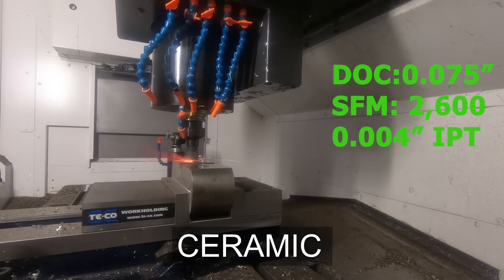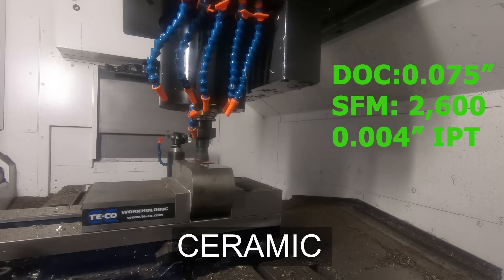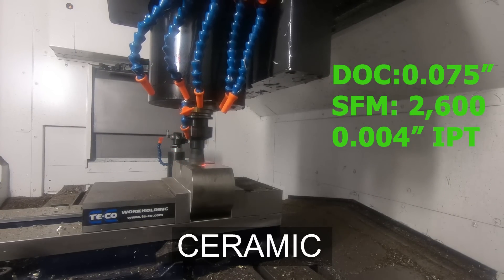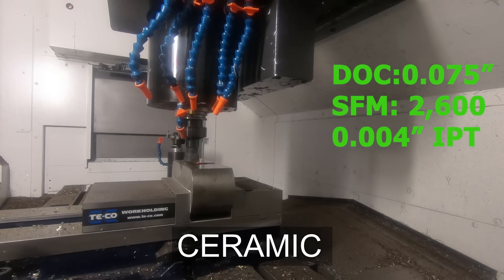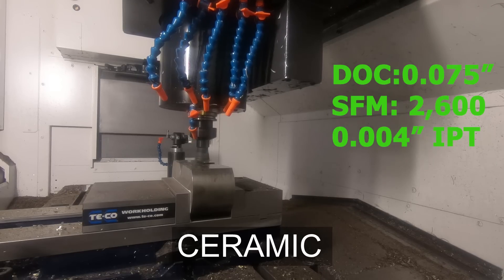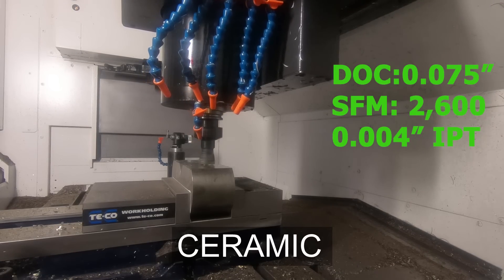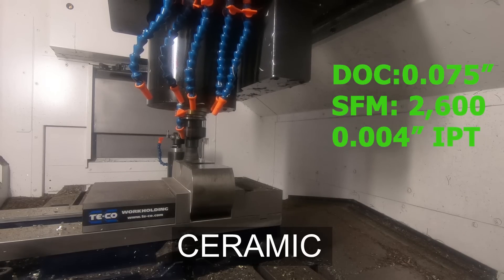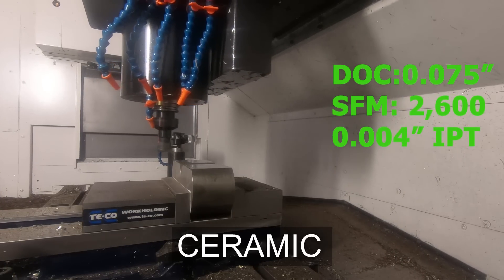You can see that it's really melting away. At every depth of cut, I would look at the inserts and you'll get about the same amount of tool life that you would with the carbide — so here it's only going to last about five minutes. But the great thing is you're going at 10 to 20 times the speed, so that is a huge saving right there.